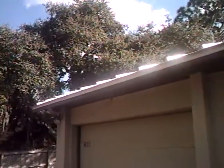You can see where I've done the ends. Closed off the ends. I really like doing that. The other video shows how I did that. And again, I didn't put any sealant on these ends, so I can allow full water to drip out from the morning dew on the underside of the metal, which was something I thought about. It made sense to me to not seal any of that, so I don't trap any kind of water or have an area that continuously gets wet and holds water. Because it'll dry out in the summer, I tell you what. As soon as that sun hits that metal, I'm sure it's going to get to temperature pretty quick.